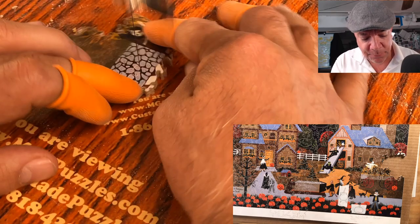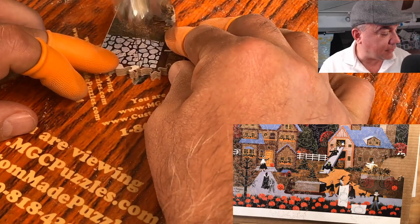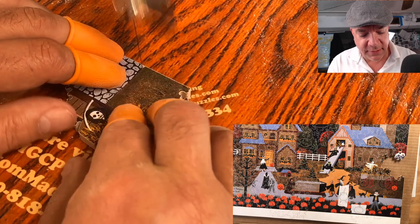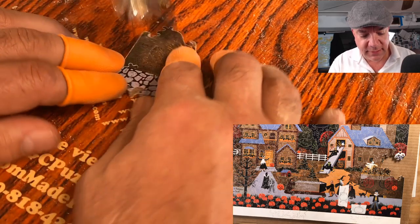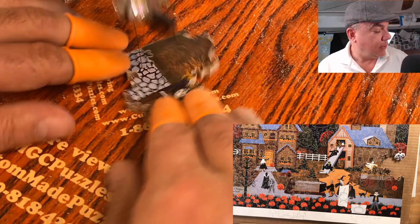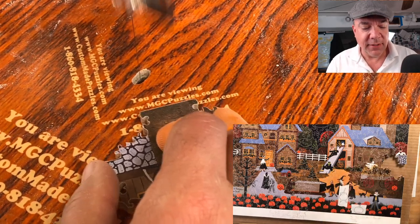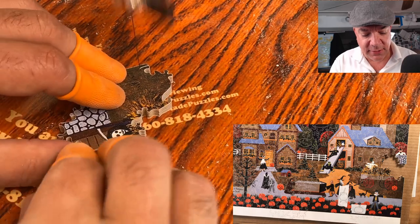I like it much, much better than Baltic birch. Even though they're both birch, I don't understand how two birch woods can be so different, or regions that they're grown in, but Baltic birch strikes me as really, really hard wood to cut. It just feels like the blade is really working to get through the wood. It also has inner layers that often have little spots where there's either rotten wood or a gap between when they start and finish a layer, when they spin the logs on the gigantic razor blade thing to peel off those thin layers like a pencil sharpener.